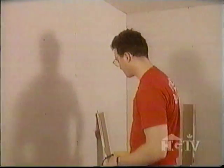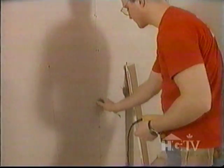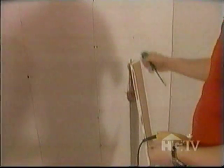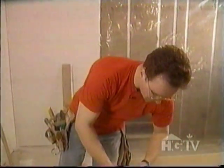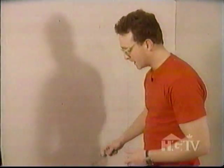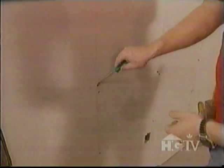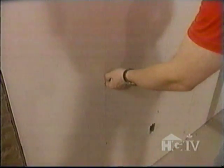When you have a seam joining pieces of drywall, don't be afraid to use quite a few fasteners. That's just to ensure that you minimize any movement there may be down in the future of the wall and prevent some cracking. Don't fuss or worry about missing the stud in behind the wall. But what you do, instead of banging the screw in, just take it out. This is a tack puller. Just hook the tack puller in behind the head of the screw and pull it out.